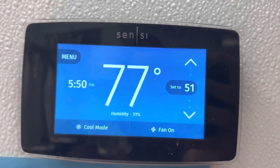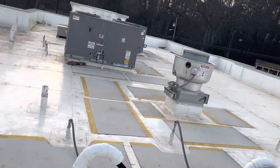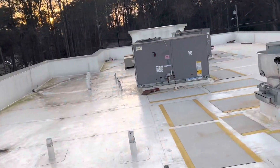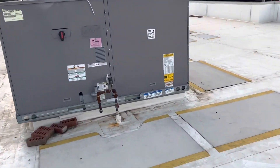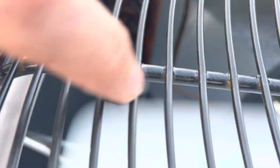We've got this big unit back of house not cooling. The coil's not frozen — you can see part of it right there. I can see the fan running, but I hear it grinding and I feel a lot of heat coming off this thing. She's going off on high pressure. Given the temperature, this fan should be running high speed and it's not — something's up with the pressure sensor.